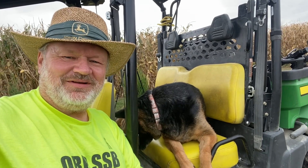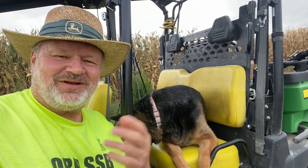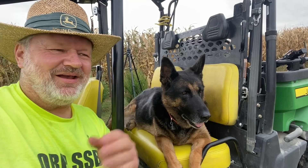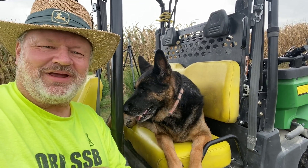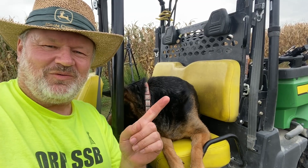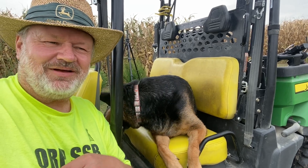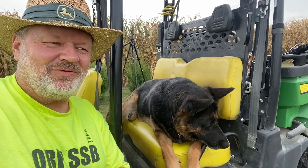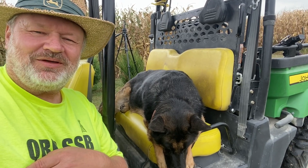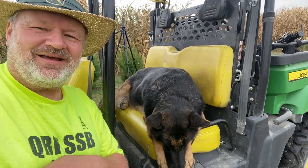There you have it — pretty simple little operation. Radio, binding post, and some speaker wire dipole. We didn't have any trees, didn't bring a mast, so we're roughing it out here using corn as our mast to get the antenna in the air, and it worked fine. Eight feet in the air, that dipole worked great. We had good audio on the stations we could hear and good signal reports. The whisper test — one watt — good omnidirectional radiation, and 109 stations heard our signal, so I was happy with that. All in all, it's a success. We're going to put that in our emergency toolkit if we ever need to get on the air real quick, and we can do it with those three things. We appreciate everybody watching the video and stopping by, and until next time, we'll say 73.